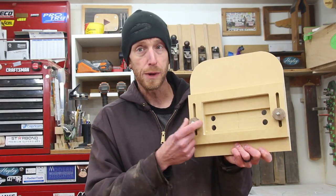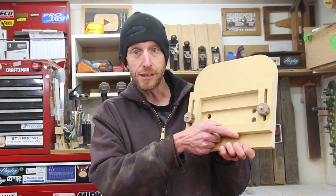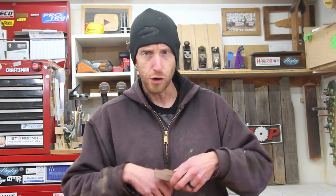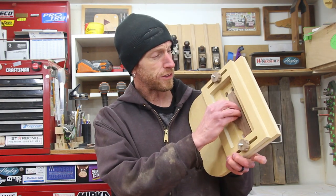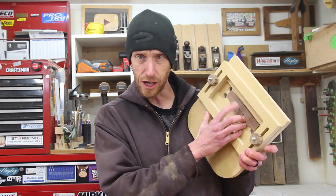After cleaning up the parts and installing a little bit of hardware, here's our jig. This thing is adjustable so that I can rotate it to get the exact angle that I need on the saddle slot. Now you may be asking: if you've got a CNC machine, why don't you just make the whole bridge on the CNC? That would be a very valid question. But my answer is that since this is my first build, I still kind of want to do things by hand. By using a jig, I want to know exactly where things need to land, where I'm cutting things, and why — I feel I have a better understanding of the process that way. So now I'm just going to stick this thing in place and drill some pilot holes down through where the bridge pins will go, then install some toothpick dowels to help hold it in place.